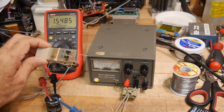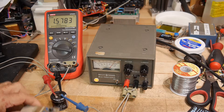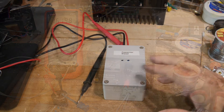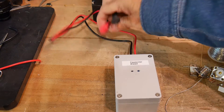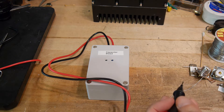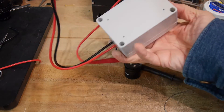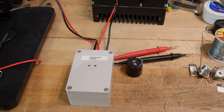Great little idea. Now I've got one. So the next time I work on these high-voltage capacitors, I can use my little bleed circuit. This is the box that I put it in — I have my little bleed circuit, I've got the leads. I can go over to a capacitor, bleed the charge off, and it's all in a nice little plastic box. I can't shock myself, I can't electrocute myself. Yeah, pretty good.